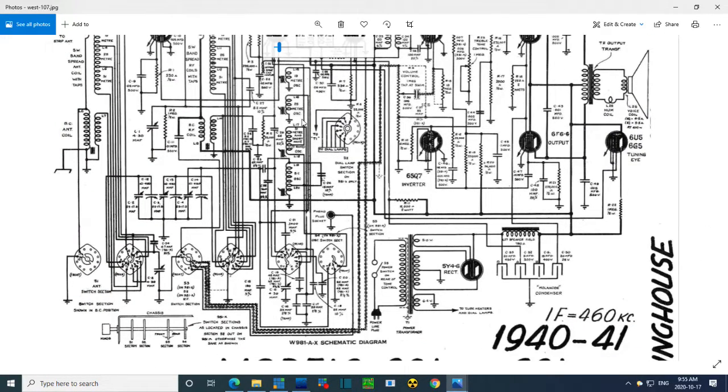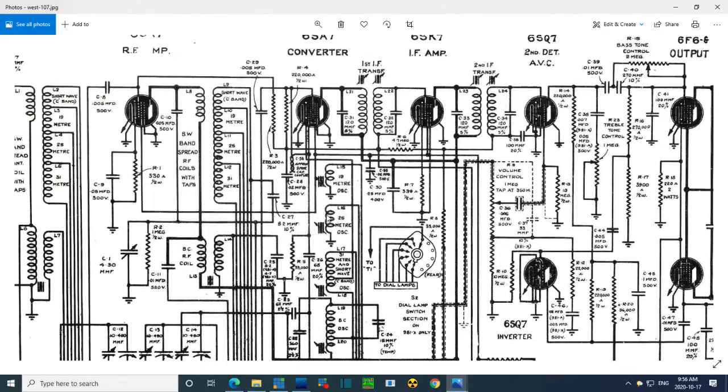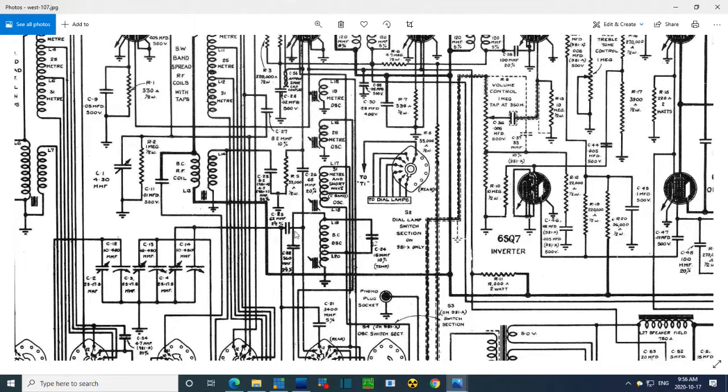There's 17. There's 18. So what's happening here is this is a center tapped coil with one adjustment. That's what this symbolizes here. One adjustment, and that's why it's doing two bands. It's not why it's doing two bands. It has been designed that way. So okay, that's what's happening. Then the C band is further adjusted somewhere here. Okay. I know what to adjust. Let's go back to the camera for a minute.